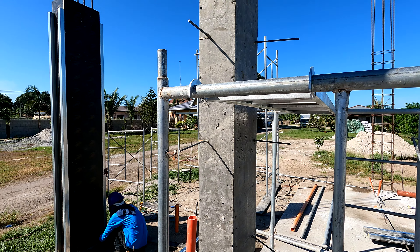Moving on to the next - again looking very nice. All the way to the top, very good. I can't actually get to the last one as I'm surrounded by guys doing other stuff, but when I looked earlier it looked good. So it looks like what we asked for has resulted in some very good columns. Thanks to all those people who suggested vibrating at three different points during the pour - your suggestions have paid off.